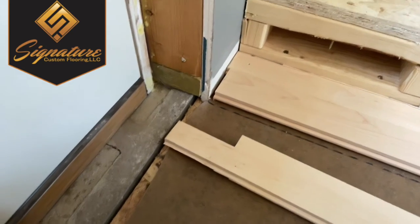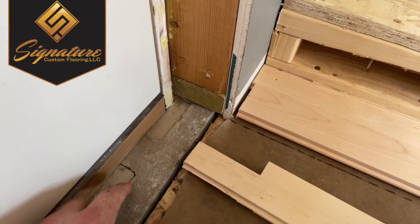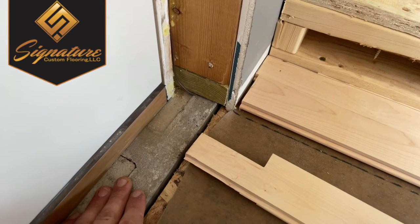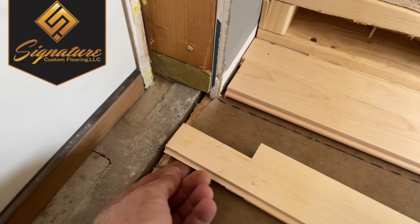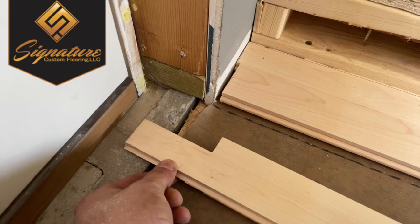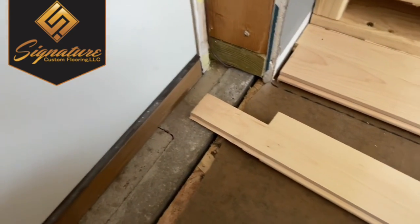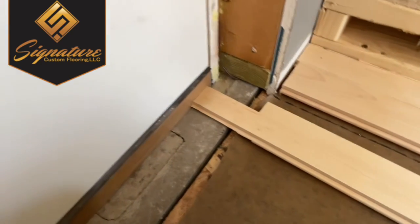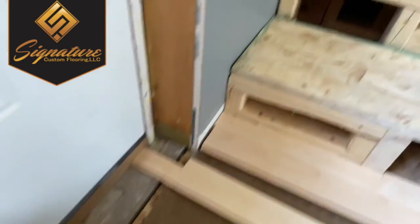What I'm going to do is put beads of glue here to keep the floor solid and in contact. Even if this is cut a little bit taller, once the glue is set up the board isn't really going to flex, and that way we can achieve a nice fit without having to worry about removing any of the cinder block.